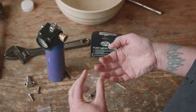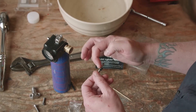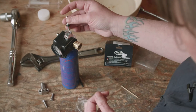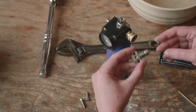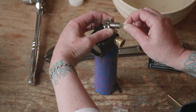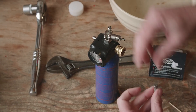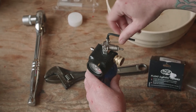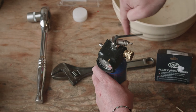Just get a little bit of grease on your finger. If it's gloppy on there, that's okay. Then just put it back in the top and push until you can't push anymore. To reinstall the top, all you need to do is pull the trigger out and put it back on, then insert your two bolts. Tighten them with your little Allen key — just go hard enough to make it snug in there.